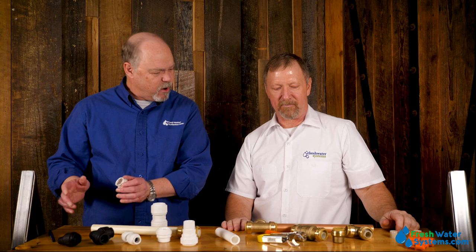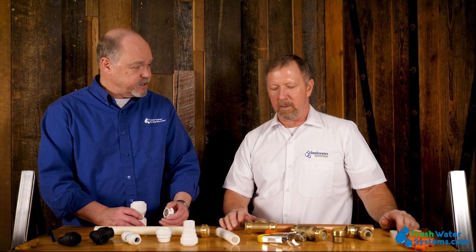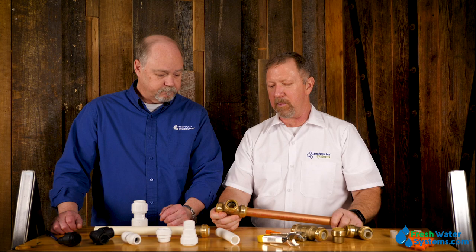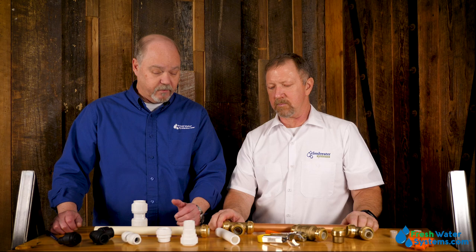I would prefer with the John Guest not to use it on copper. I'd be more apt to think the plastics — CPVC and PEX type tubing — are a better application for the plastic push-to-connect John Guest. Would copper be the best for SharkBite? Because of the design of the body being all lead-free brass and the increased temperature and pressure considerations, it's definitely a better fit for copper. In terms of reusability, SharkBite is better if it's one-and-done — you're not really planning to undo that connection and redo it — though they can be reused in the right application.